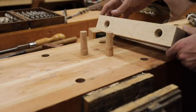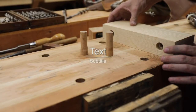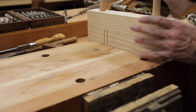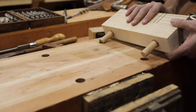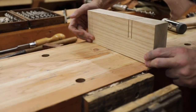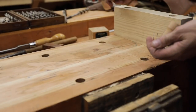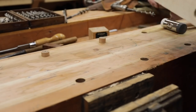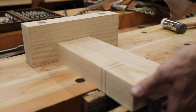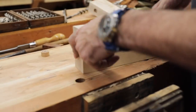I had to modify the two pegs a bit. As is typical, my plans don't always work out — I must have got the spacing just a tiny bit off. There's always a solution: I put a taper on the pegs, so those will fit nice and snug in there. We should be able to put this in here and secure it. It doesn't have to be super tight, but it has to be strong and not wobble. When we want to take it out, we can do that. We don't need to glue the pegs in because we can use them for future projects — put them in the bench holes as stops, or clamp things against the bench. Multi-purpose pegs.